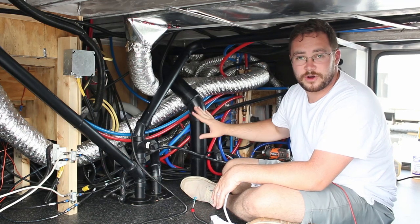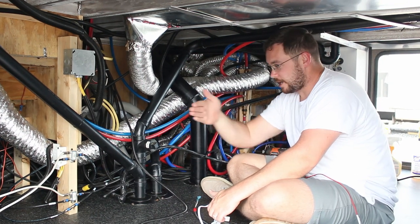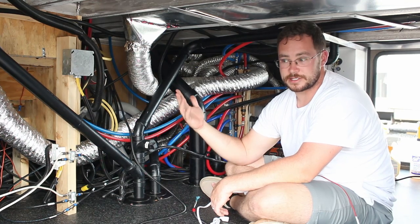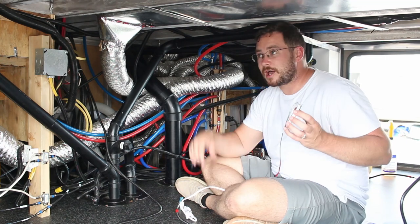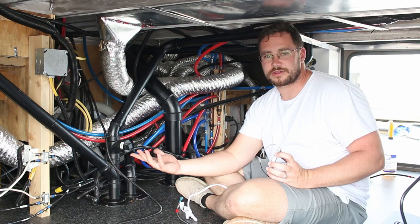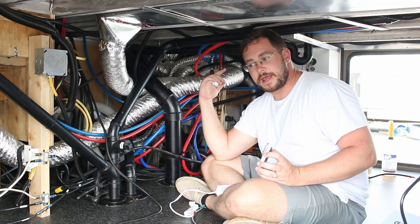Cable management is done to the best of our abilities, got everything cleaned up and now we're ready to start putting things back together. Originally the wall was about right here and now it's going to be pushed back about right here. I was thinking three feet, it's actually like 14 inches — not a big deal, but every little bit of space is nicely used. What I'm going to do right now is hardwire in some LED lights to go along here and along the other side, because we're getting rid of the motion sensor lights. They're not very bright to begin with and they're kind of annoying — they don't light up anything well. So we're going to get these wired in and hardwire it into some of the wiring back here, then put the walls up.